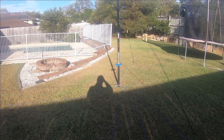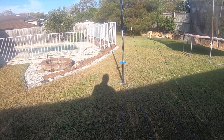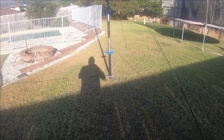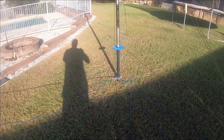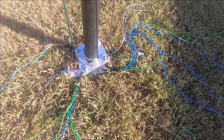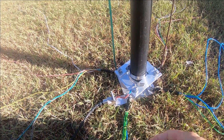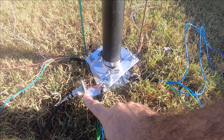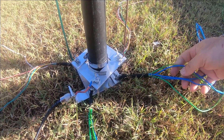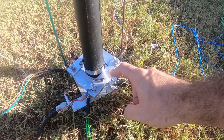EX Commander Inspired M0 MCX. Allen put this together with stuff that I've had lying around. About 20 radials, two and two-and-a-half to three meters each, some aluminium to connect the ground to a stack of radials, and then the center of the coax comes to this aluminium plate.